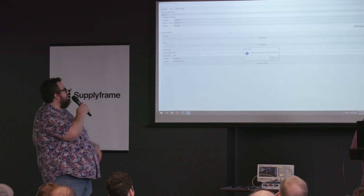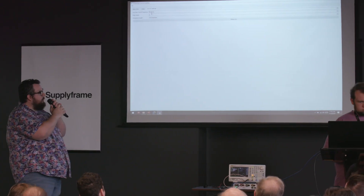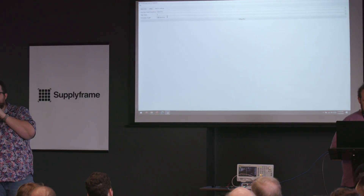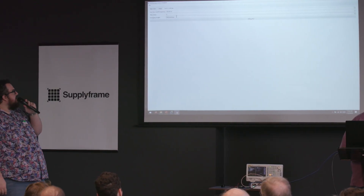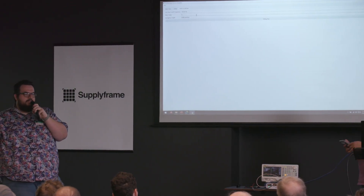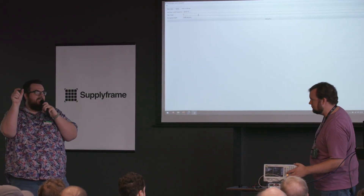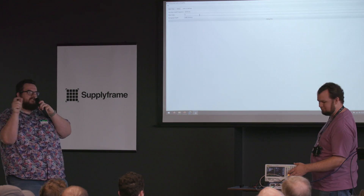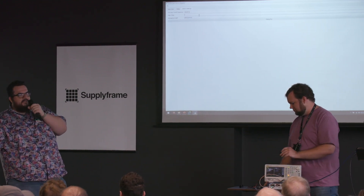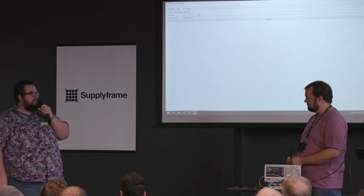Here's our GUI, which supports multiple instruments and is designed to make it easy to add support for arbitrary instrumentation. The key settings are: bandwidth — how narrow a lock-in filter do we need; filter order — how sharp the roll-off should be; and averaging length — in our system we average for a good period of time to get a clean measurement.